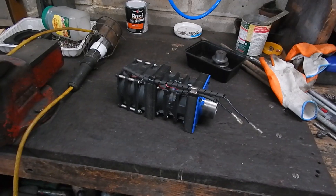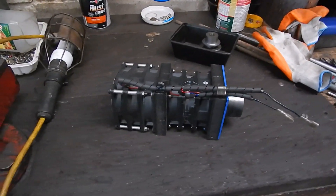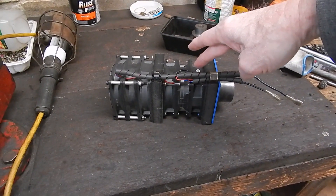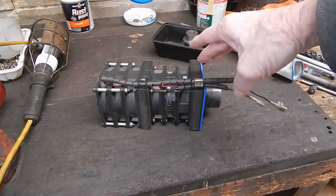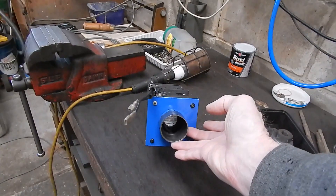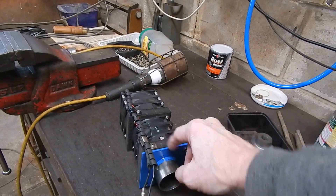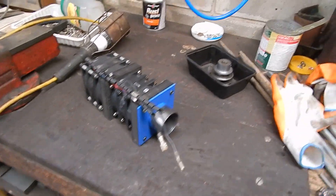Here's the blower - it looks like some sort of alien weapon, but it's actually four computer case fans: two big ones with a separator between them and two smaller ones with a separator. You put the separator between them to cut out the beats effect - that throbbing is really annoying - so it smooths out the airflow. This is the bit you'd recognize from the last video that I made up using the Bullfinch to bronze braze, and at the back between that and the end plate is an o-ring so it's all sealed.